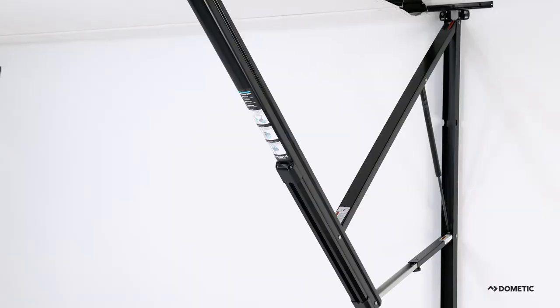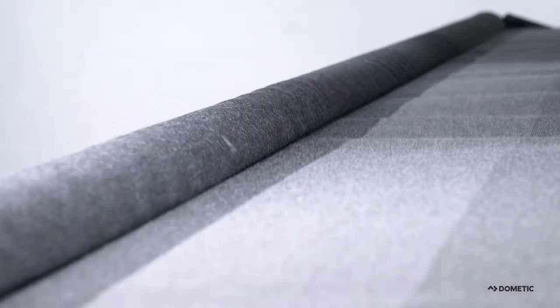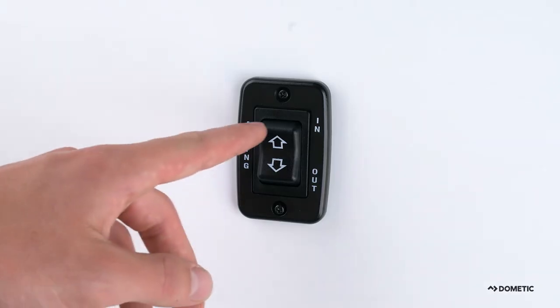Be careful not to overextend the awning. An overextended awning has hardware arms that form a straight line, a valley behind the fabric roller tube that can accumulate water and heavy debris, and a valance that does not hang straight down.